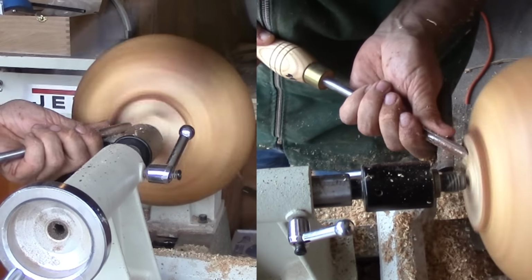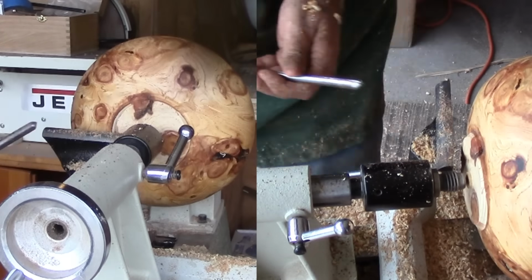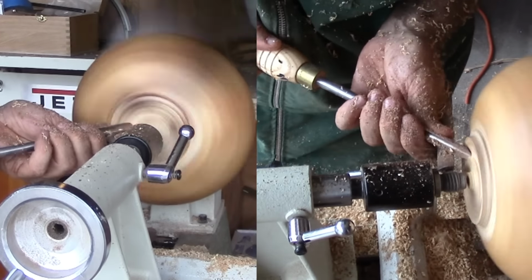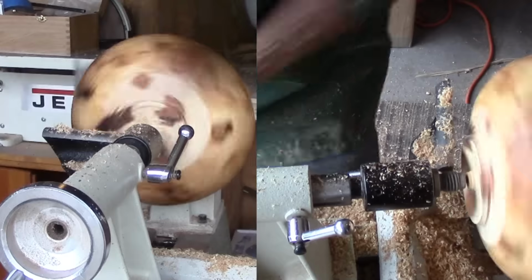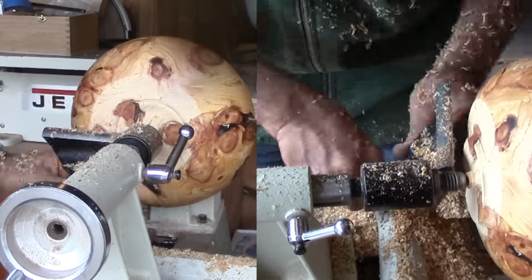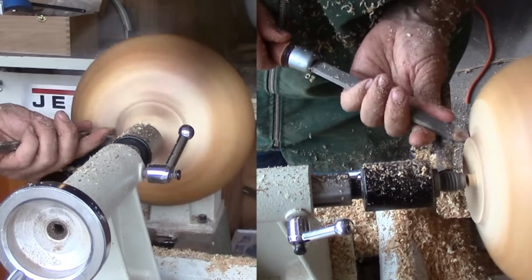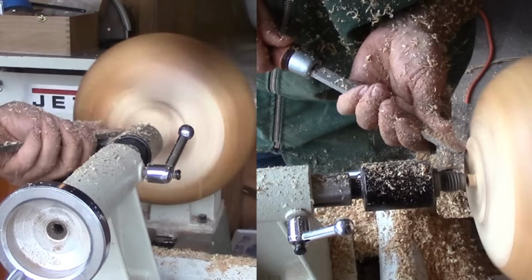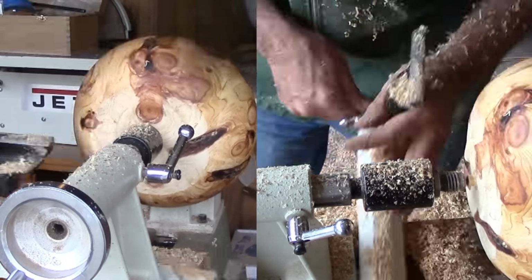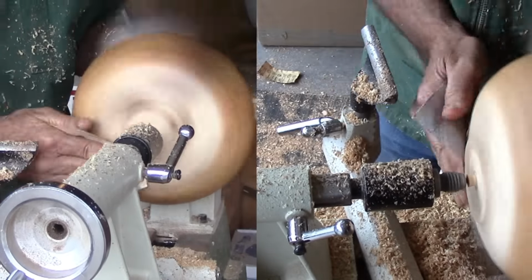The bowl was off-center when reversed. It's no different now. After several tries to center, I decided to proceed but blend any change into the rest of the bowl. Finally, sand it out with beeswax and mineral oil. Finally, I gently scraped out the soft bark from the bark inclusions.